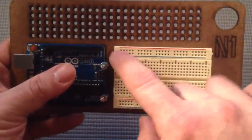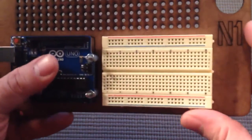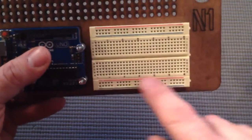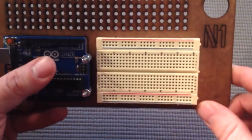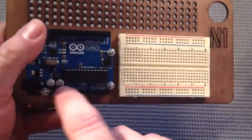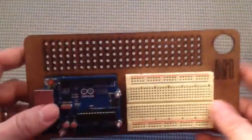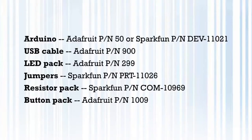You'd have to use a wire or jumper to connect the two sides. These strips are called the power bus — that's the red one — and the ground bus — that's the blue one. There's also a ground bus and a power bus on the other side. The power and ground bus strips are connected horizontally, which contrasts to the middle section where the conductors are connected vertically. You want to plug everything that requires power into the power bus and connect it to the 5 volt on your Arduino, and the ground similarly plugs into a ground on the Arduino. I'll be using this board pretty much the entire video series.